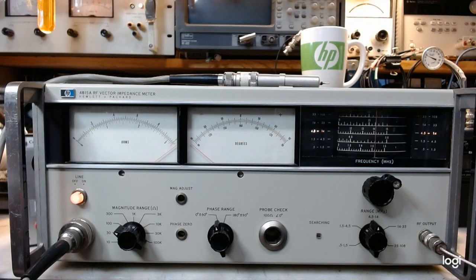The bottom line is the closer you get to 90 degrees, the higher the Q. When you have a Q of 200 or 1000 you can't tell the difference with this device. It shines up to about the 85-degree range, then you start to lose accuracy because the sensitivity of Q to the angle increases dramatically toward infinite Q. So it fills a hole — if you want to measure high Q things, use a Q meter.